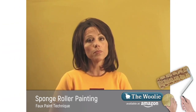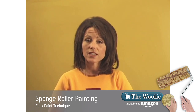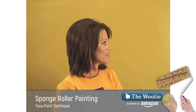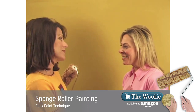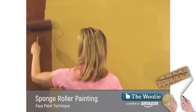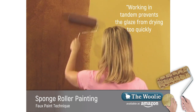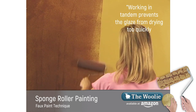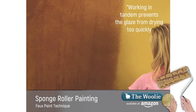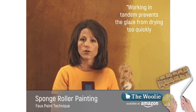In order to create this look, you'll want to apply glaze to the surface using a roller. The most efficient way to get professional looking results is to ask a friend to come and give you a hand by rolling on the glaze while you finish up with the tool to create the look. I've got my friend Julie who's going to give me a hand. Julie's applying the glaze to the surface in columns using the roller. She wants to stay a couple of columns ahead of me so that the glaze does not have an opportunity to dry before I can create the faux finish on the wall.